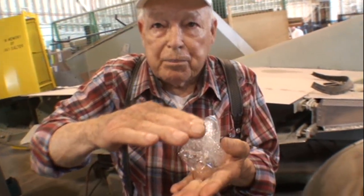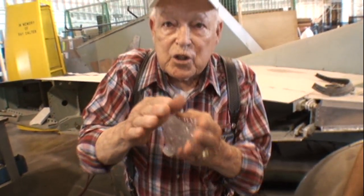No, this aircraft is designated to go to California, probably San Diego, on the Hornet. Oh, the museum carrier out there. Right. We had these wings, as you saw, built, completely finished, and they came in from California and said it's got metal light in it, which is a piece of aluminum covering a piece of cardboard and then another piece of aluminum. It's sort of like a sandwich. And it's light, and that's what they use for skin. But they didn't want that because they thought the cardboard would deteriorate. So they want us to take all that off and put on solid skin. That's the reason Watt is working on that.